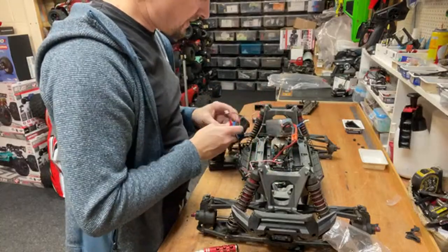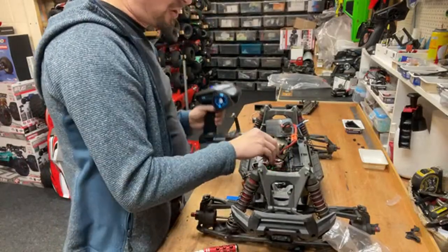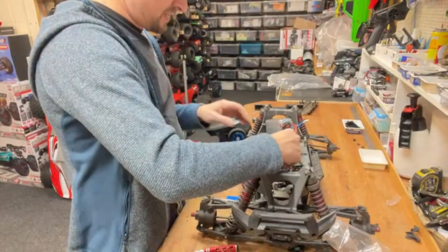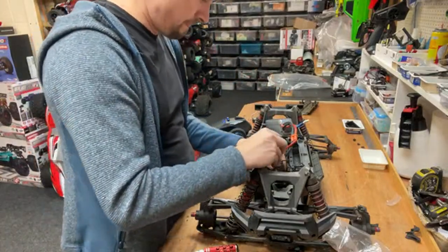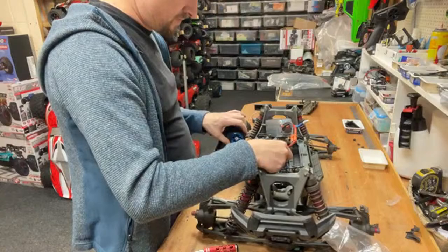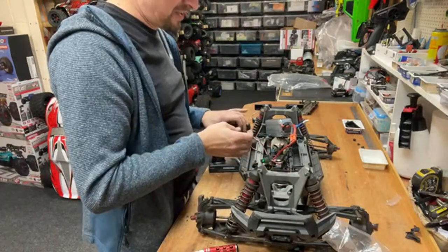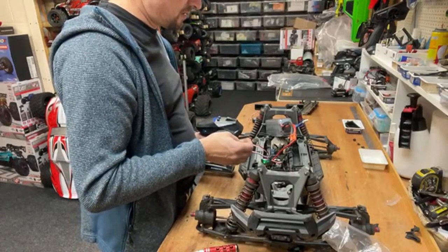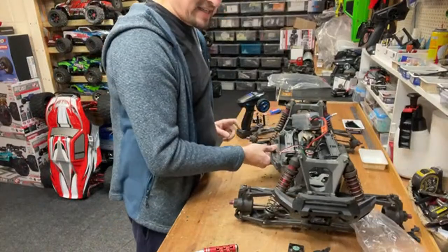Right, so now we know we've got a battery plugged into the receiver. We know that the radio works. And if we plug this one into the throttle port and do the throttle, steering still works. We know that both ports work on the receiver. So then we get rid of this battery pack and we plug the receiver back in. So we could actually go in there and turn up the BEC voltage. Right, power. Oh, it works! Right, so that ESC is good.